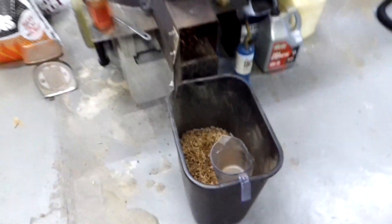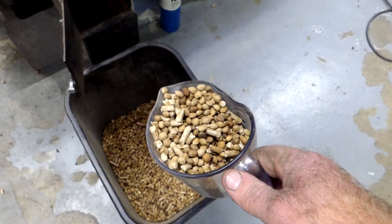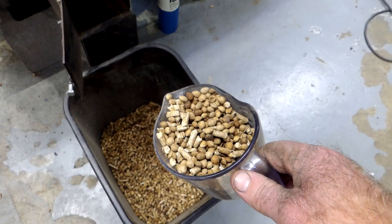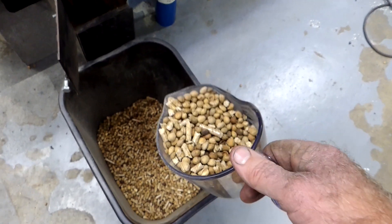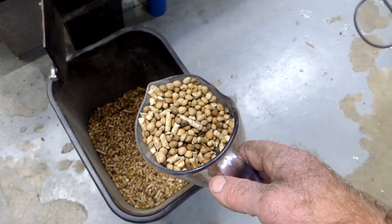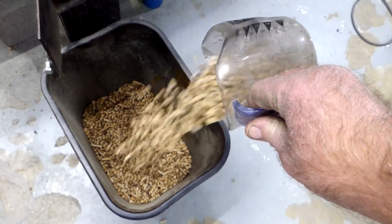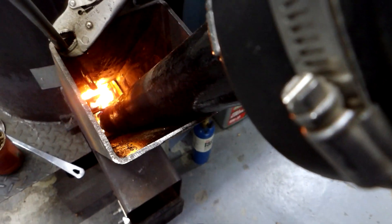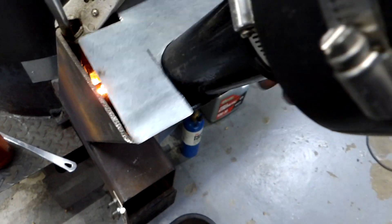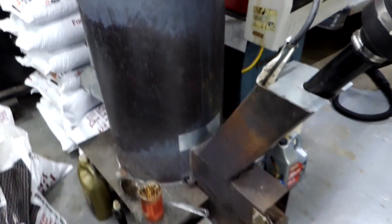I found out that burning pellets and cherry pits are the ticket. I've got a mixture of northern Michigan cherry pits, which seem to help the pellets run down the burn tube a little quicker. Straight pellets burns hotter, straight cherry pits not as hot. Right now I've got about three parts cherry pits to one part wood pellet because it's only 35 degrees today. If it's 100% wood pellets, every once in a while they'll hang in the burn tube. If I was to do this over again, I would make that angle a little straighter for that reason. If you have any questions, feel free. Thanks for watching.